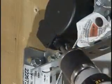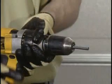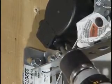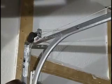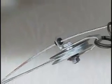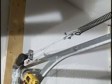Then wind the worm drive on the black housing with a standard 3/16" drill, using the 1/4 inch hex driver provided. Make sure the 1/4 inch hex driver is inserted completely into the worm drive. Check that the drill is set to operate in a clockwise direction to tension the spring. Using the drill, go ahead and start winding both springs until the black bushing installed on the flange of the sheave forks covers the red marks on the safety cables.